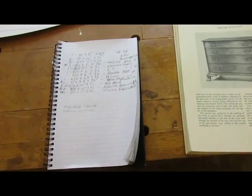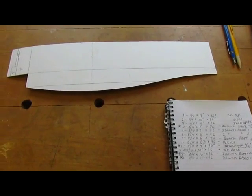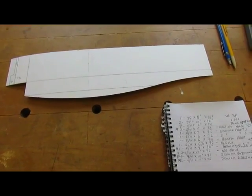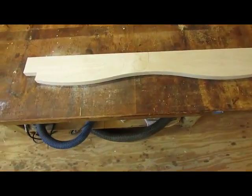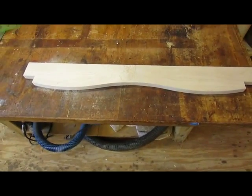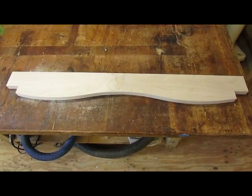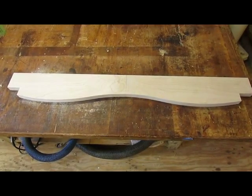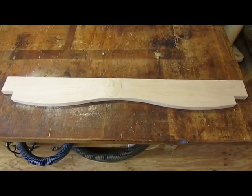Over here I've got a materials list that I made after I made the drawing. And then this is a cardboard template for the blades and the drawer fronts — and of course that's half size. Over here I made one drawer blade to see how I like the curve, and it seems pretty good. It's a 5/8 of an inch curve. I originally had it doubled to an inch and a quarter, and Doug Mulder helped me out. We redrew it, and so this is the proper shape.